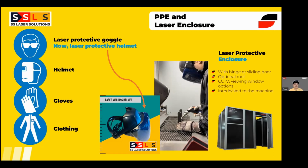So when it comes to protective enclosures, there are different materials which you can use, or you can ask your PPE manufacturer to use. But basically, you need a laser protective enclosure. The standard welding curtains, which are available in every fabrication shop, are not laser protective. If you try to hold the gun, even from a longer distance with lower power, in a short period of time you can damage it. So I would advise going for a bespoke one.